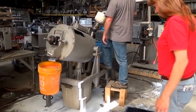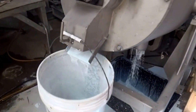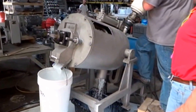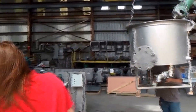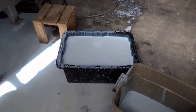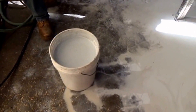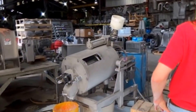We'll get some sludge coming out, get stable conditions, and start a timed test. We've got the test started — we're 20 seconds in, coming out thicker this time. Not as much flow; we've cut the feed down, hopefully we guessed right. Our test ran three minutes and 23 seconds. We got this bucket of sludge and that filtrate — we're going to weigh these, send you samples of the two materials, and run this one in the CP4 press to see what we can achieve.